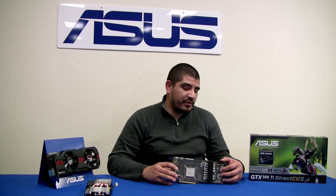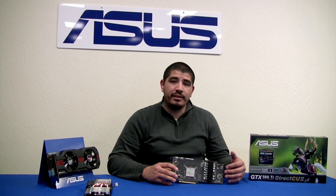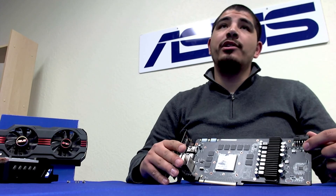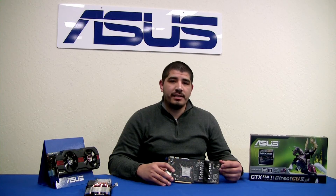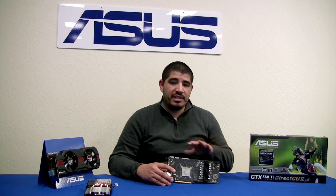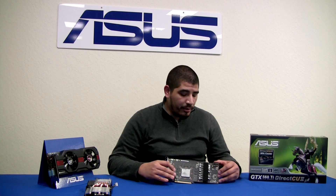At the end of the day, this just provides a better class of part for better operational efficiency — meaning lower temperature, longer lifespan, and more headroom in power delivery for overclocking. We've also done some protective design implementations: you can see we actually have fuses here in the corner. This is a special ASUS exclusive design we call fuse protection — a fail-safe mechanism to minimize any type of damage to the GPU from an overvoltage or overcurrent issue, such as spikes, surges, or sags that can occur with variances in power supplied to the card.